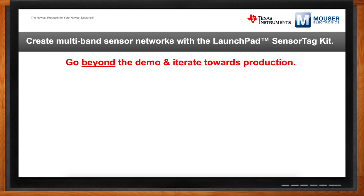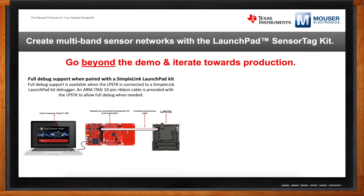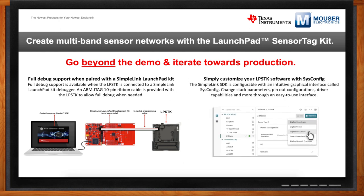This is really where the real fun begins — where innovators can bring their ideas to life much more quickly while leveraging the LPSDK as a jumping-off point. Using our Launchpad development kits, they have an onboard debugger that allows you to plug in over USB and wire that over to the LPSDK to take advantage of that debug probe. This allows you to not just download new code to your LPSDK, but set breakpoints, watch memory, watch variables, and fine-tune your application so you can feel comfortable building 10K, 100K, or a million of these things.